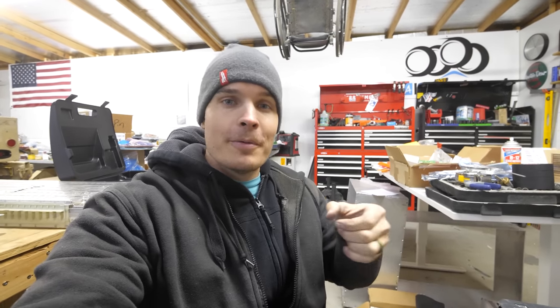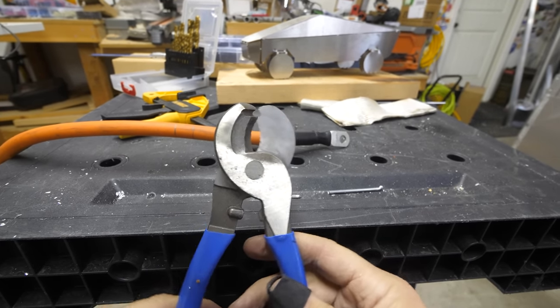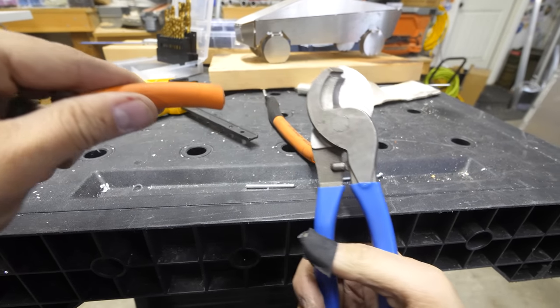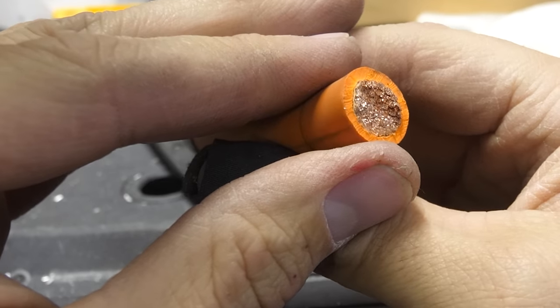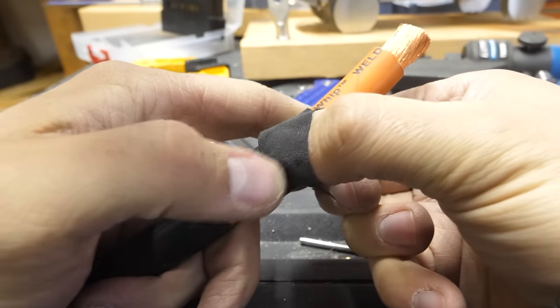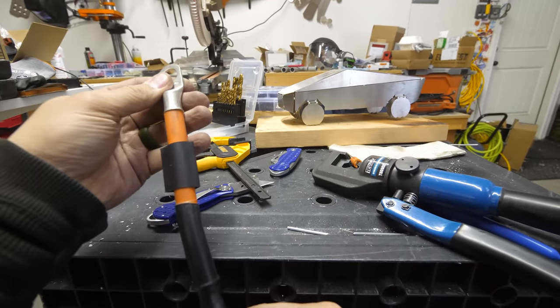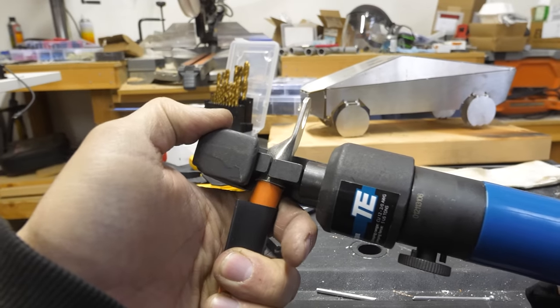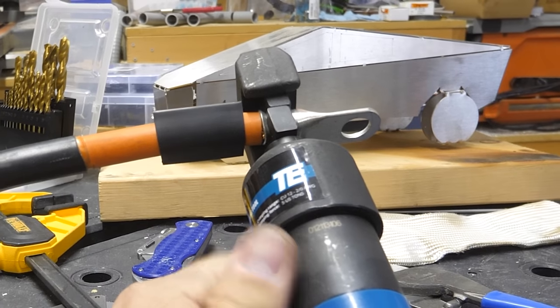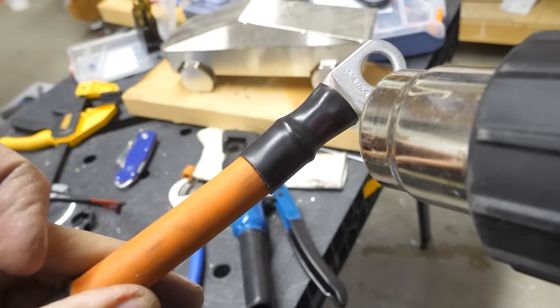When it comes to the high voltage orange thick wire — the 2/0 cable — remember: the higher the gauge number, the smaller the wire, and the lower the number, the bigger the wire. The 2/0 wire is two steps below zero and is designed for a continuous 250 amps. It's made of copper strands all working together. The ends of the 2/0 cable are called lugs, and I can use my hydraulic crimpers to securely attach the lug to the cable, followed by black heat shrink with a heat gun — there's glue inside the heat shrink to keep it watertight.